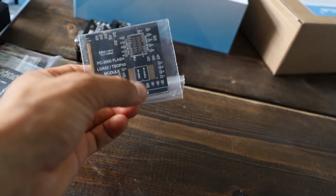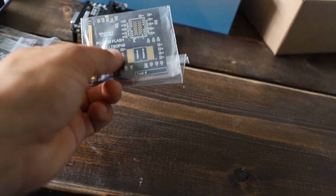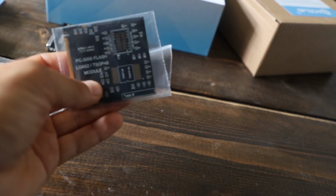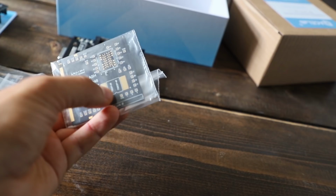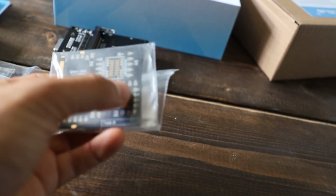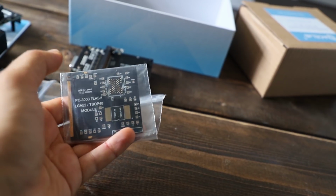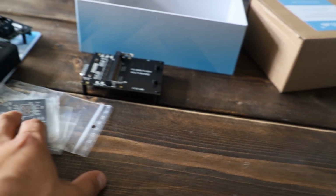For example, one of the cases that I worked in the past needed to be wired up entirely to a NAND flash adapter, but because there's a TSOP48 template that already exists here, we could have just used the existing pads, line them up with corresponding pads on the NAND, and then headers that got damaged could be just jumped with a small jumper wire to the pad to make full contact. It's a very useful piece as well.